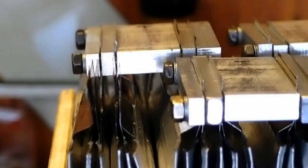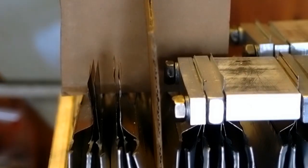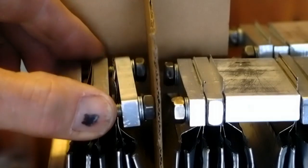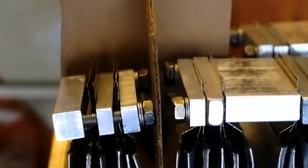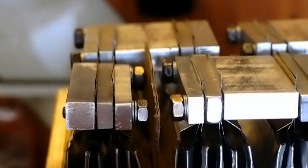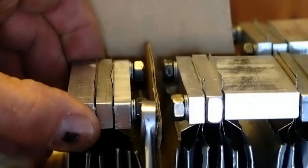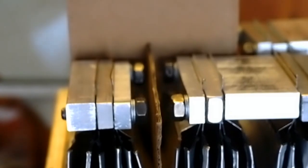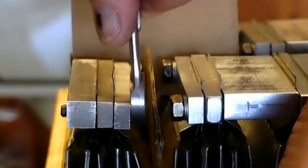Now I'm going to show you putting the aluminum block assembly onto the six tabs. First you put a little cardboard protector in there so you cannot accidentally touch neighboring metal parts — they tend to spark and get warm. The cardboard is in place, and here comes the assembly right on over. I tightened it finger tight, then came in with a wrench once the cardboard piece was back on. You get it straight and snug it down really good. You will notice the Nord-lock washers — I did invest in those. And that's it for building the battery.